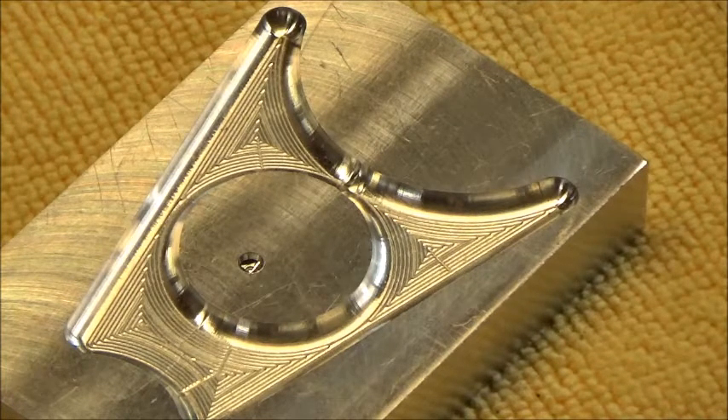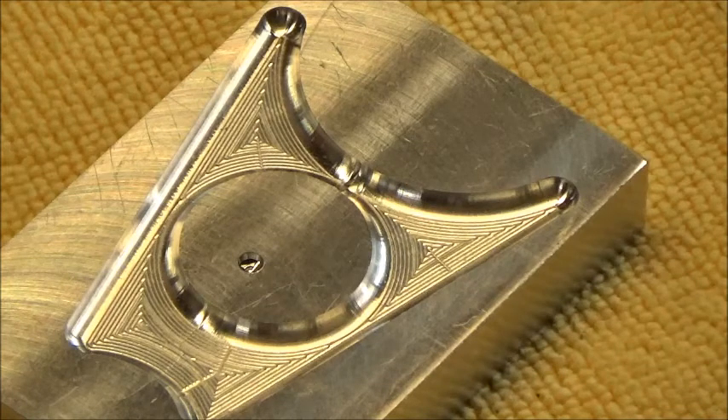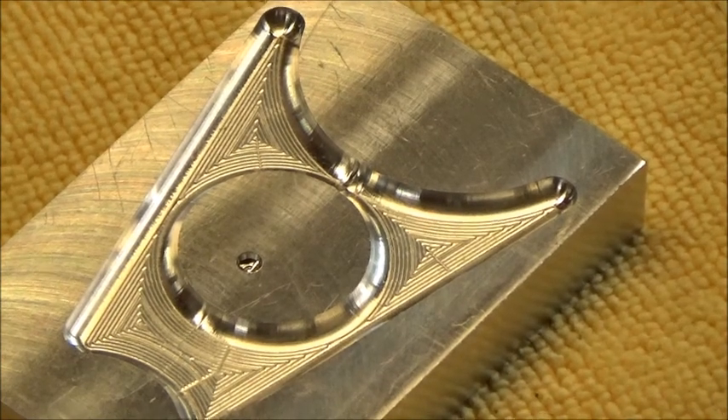These insets will be painted, and the paint will probably fill that in, but some I've seen done by others look pretty rough. I was trying to get a really fine finish at the base of the cut. I could probably go 5-10% step-over but I'm thinking that will be good enough. The edges came out beautiful, the whole thing came out nice. I'm going to use that kind of setup - bulk passes at 40% then finish at 1% - to do all the insets on the different frames. Thanks for watching.